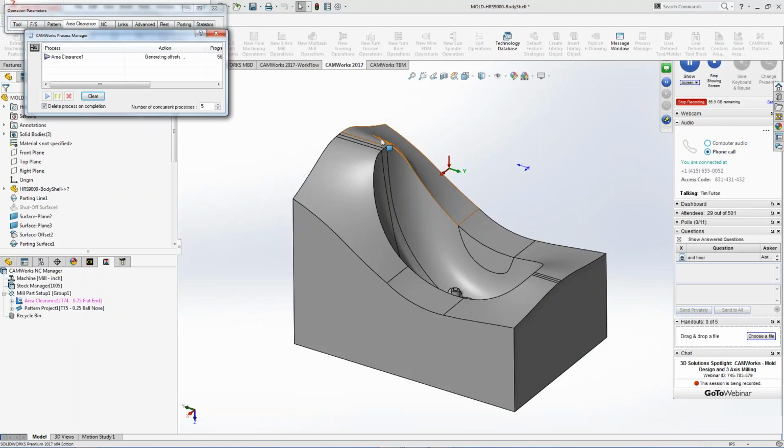What it'll do is take all those toolpaths that you saw that were going down inside there, step it down 1 inch at a time, and it'll actually bring the tool back up the wall to be able to do the finishing that's inside the part. So you don't have to step down 100 thou at every layer, based off these new algorithms that run in the background of making this thing work.